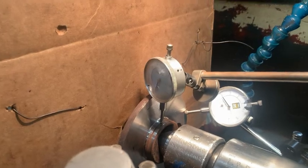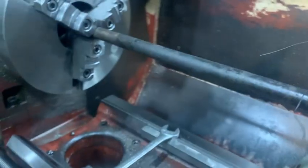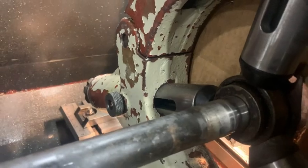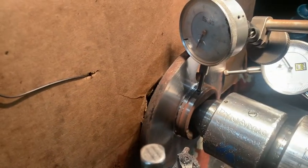So they've been welded up and this one's been machined. The center is not in there right now — it was just there to line it up and grab the steady rest. We spin it just on the bearing itself. We were a little bit careful about heat when we welded them; they were preheated and post-heated.